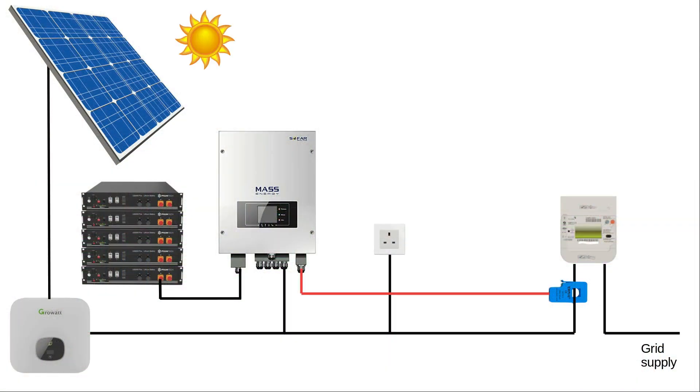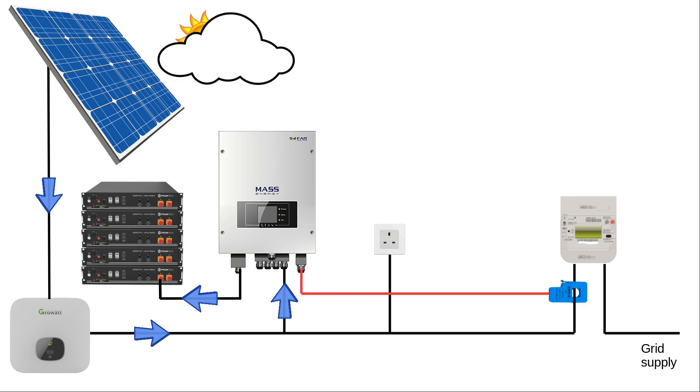That's how discharging works. For charging, particularly with solar: the sun comes out and your grid tied solar inverter starts pulling power from the panels and generating AC, which goes out onto the grid. Your battery inverter looks at its CT clamp and sees you're exporting 1,000 watts. It knows it needs to charge the batteries, so it takes a thousand watts of AC, converts it to DC, and charges the batteries. The next time it checks the CT clamp it sees nothing going out - it's using all available spare power to charge the batteries.